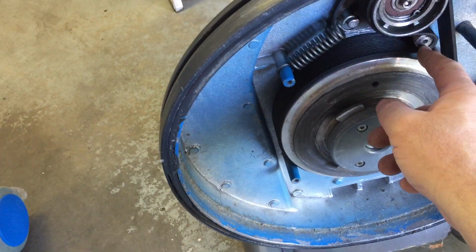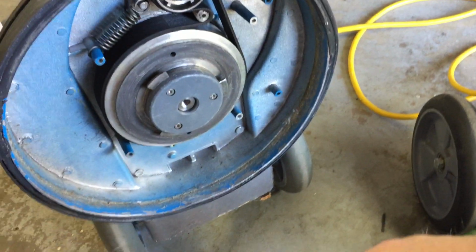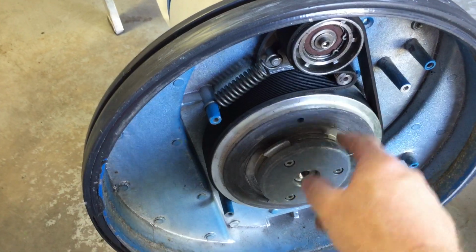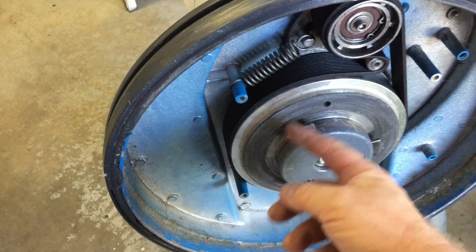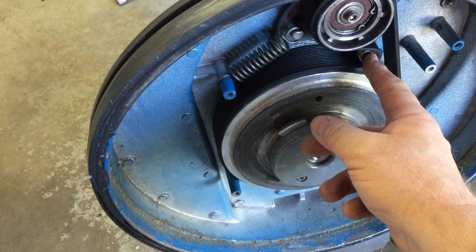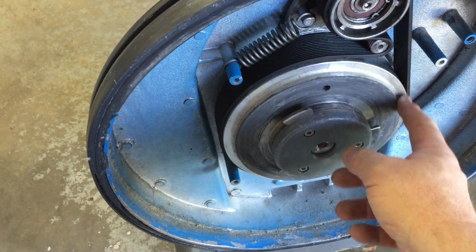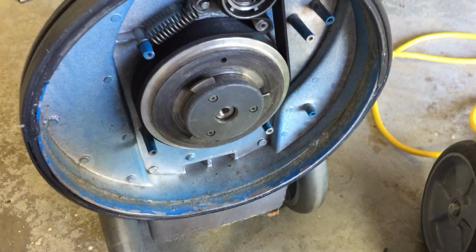And so it's a belt drive, so this is spinning, I don't know how fast it spins. Pretty fast, actually, but many more revolutions here than here. And this is actually the drive portion of the machine. The motor spinning here probably spins 30 times to this once. So this spins real fast, and this reduces the speed but multiplies the torque. That's what I'm trying to say.